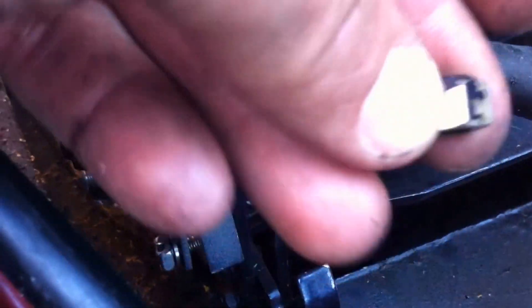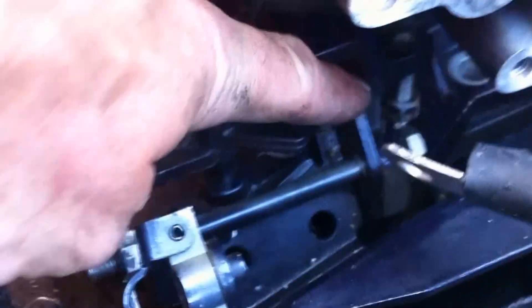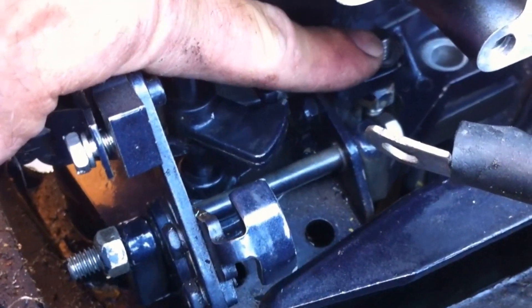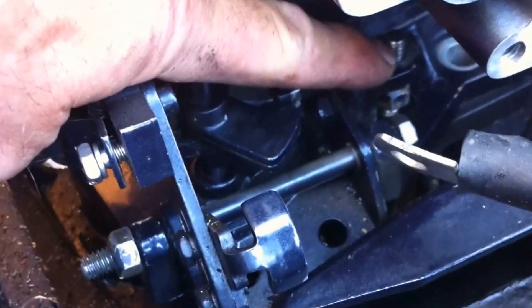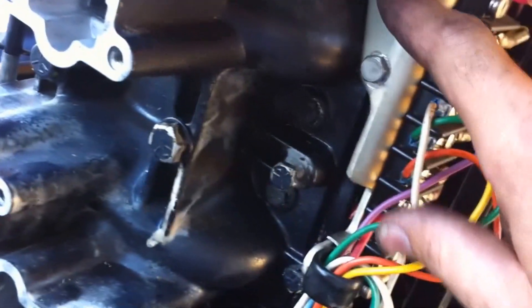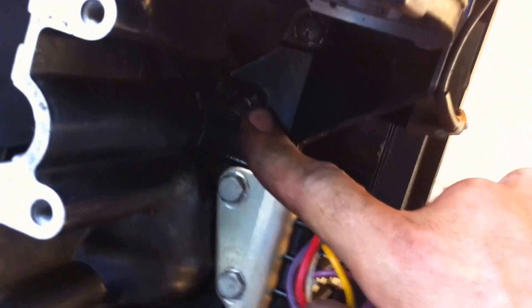There's the lower nut, and now I'm going to take this nut and put it on the top of the interlocker lever here — right there on top of that. That's for adjusting the shifting shaft. I'm throwing this wiring harness on here. There are three screws that actually hold the crankshaft front cover. You'll notice the rest of them are black — I thought I lost them because the rest are black, but I did mark them. So make sure you mark anything that's different with tape or whatever.